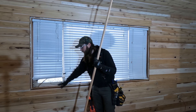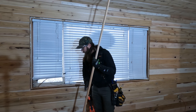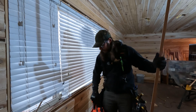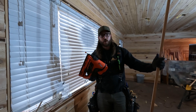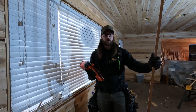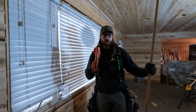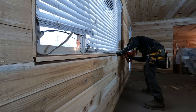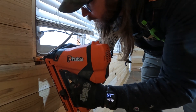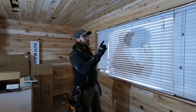The original window was stained and the casing was stained as well. The customers have decided they want to keep that stained look, so we're going to set our jamb extension with a slight three-sixteenths reveal right to the edge of that stain line. Our casing will then have another three-sixteenths inch reveal and it'll give it a good step-down profile. To apply this jamb extension I'm going to use a sixteen-gauge angled finish nailer — the Paslode model, running inch-and-a-quarter angled finish nails. I like to run jamb extensions with a sixteen-gauge and then do the casing with an eighteen-gauge nailer. We'll shoot toward the top and make sure we get right into that jamb. Now that we have the bottom piece on we'll fit the top and then put the two sides in.